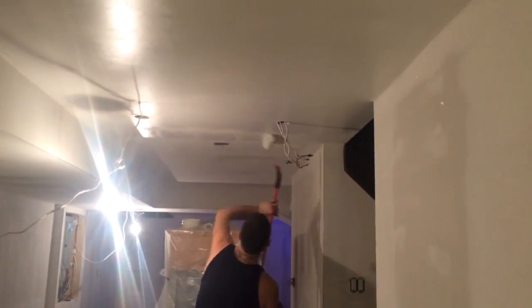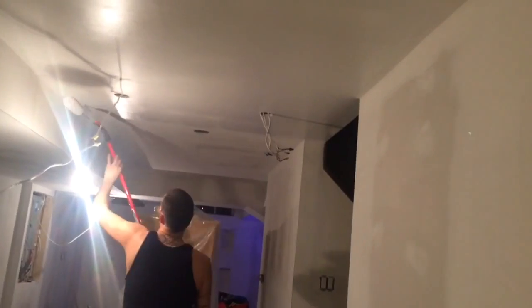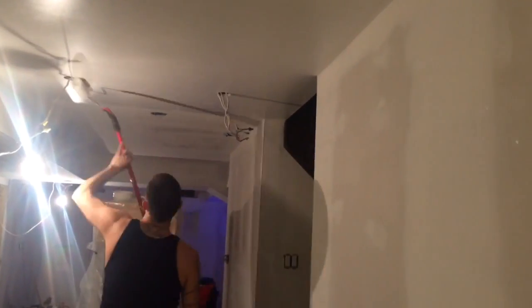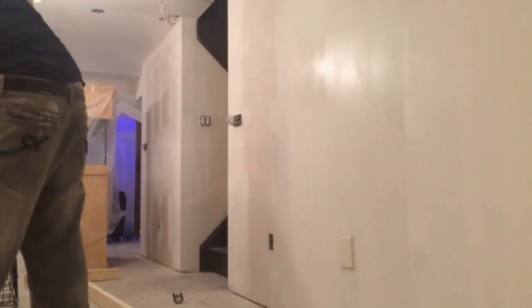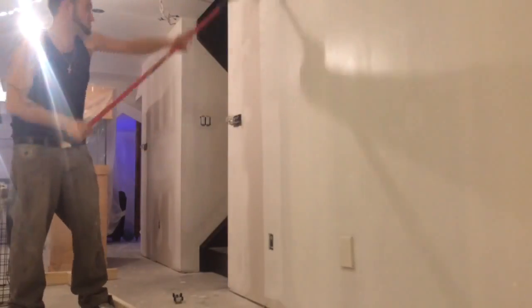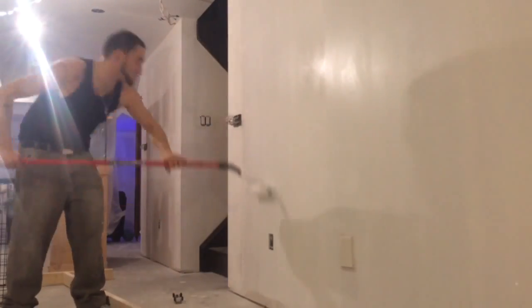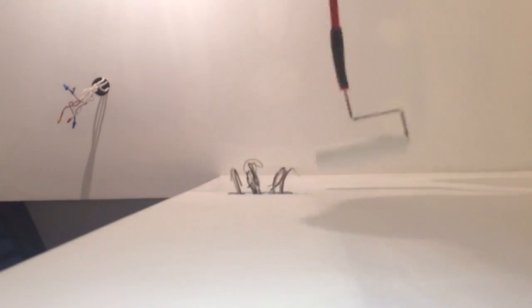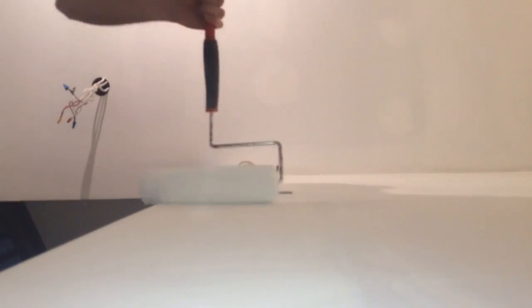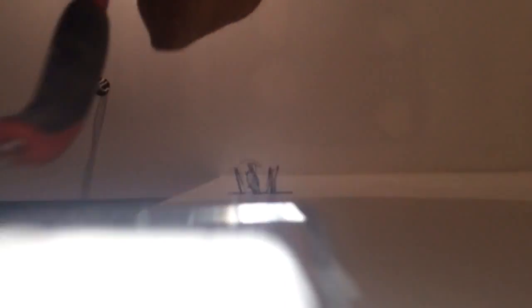Here's another picture of the before — you can see the framing work of the bulkheads and the walls. I'm giving it a nice thin coat. I'm going to give the ceiling two coats of primer and the walls just one coat. Since the ceiling is going to be white, an extra coat of primer means I won't use as much ceiling paint — it'll just be more white. Here's another fast-forward clip of me priming this wall near the stairs in the basement.